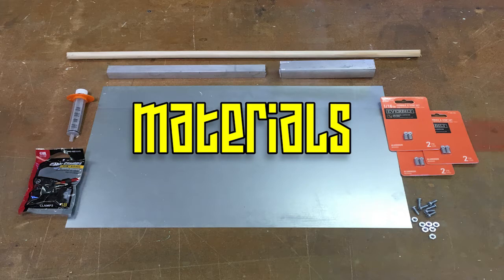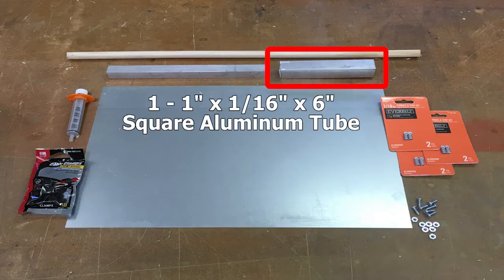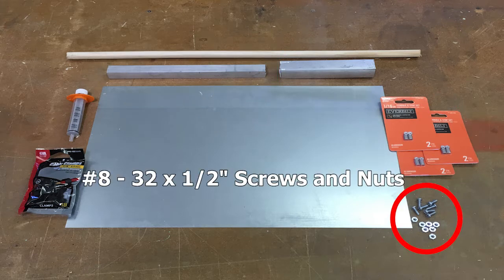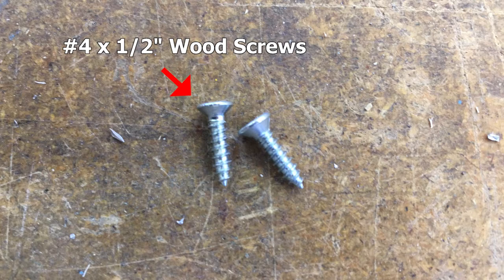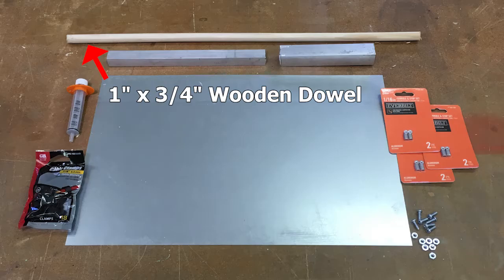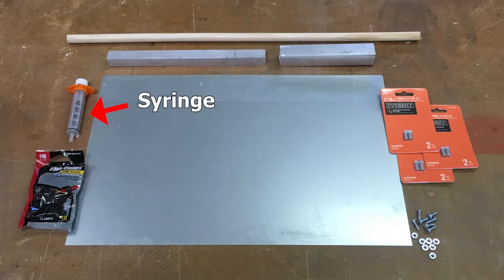Now, the left hand control mechanism is itself a bit tricky to build. You're going to need one 12-inch by 26-gauge by 18-inch piece of sheet metal, one 1-inch by 1/16-inch by 6-inch square aluminum tube, one 3/4-inch by 1/16-inch by 10¼-inch square aluminum tube, three ferrules, number 8-32 by ½-inch screws and nuts, one number 4 by ½-inch wood screw, one 1/4-inch cable clamp, a back brace, a 1-inch by 3/4-inch piece of wooden dowel, one 1-inch by 3-inch by 3-inch piece of plywood square, a syringe, and a 2-inch spring.